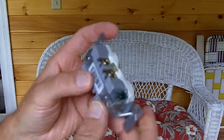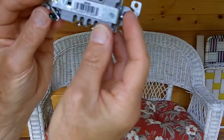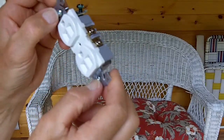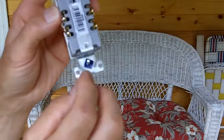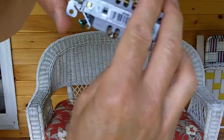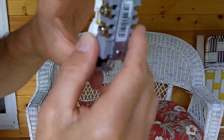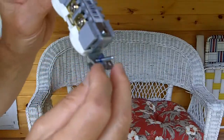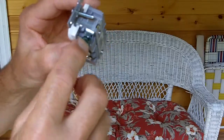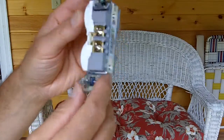So that's a nice device. The other difference is these two screws right here — that's used to hold the device inside the box, to retain this device in the wall. And you have a spring clip right here that's bonding with this screw. That provides the bond you need between the metal frame of this device and the grounding conductor of the circuit, which is important.